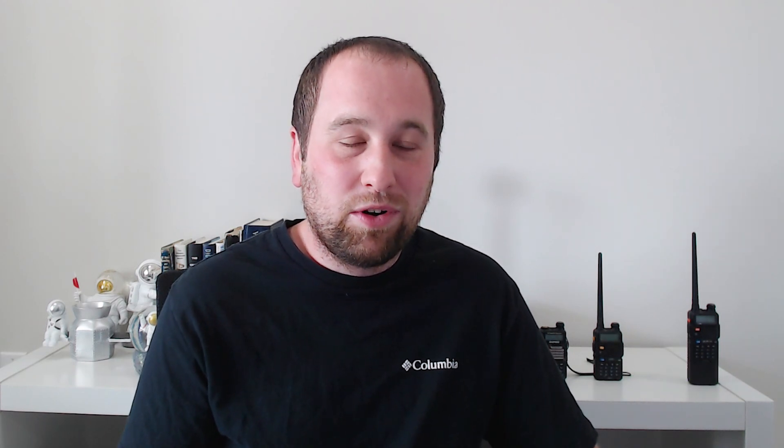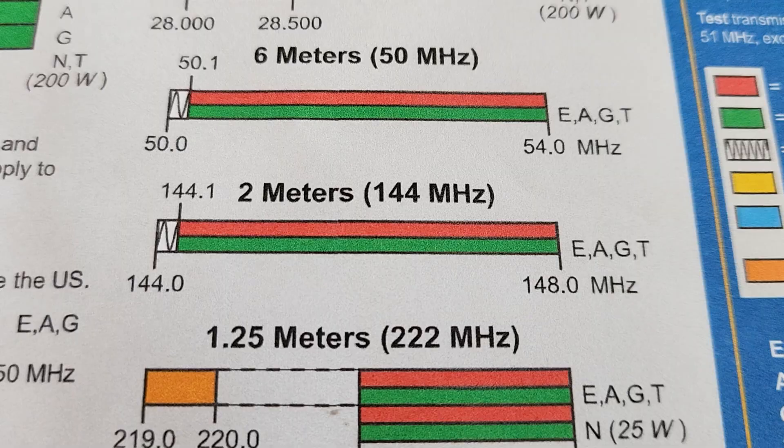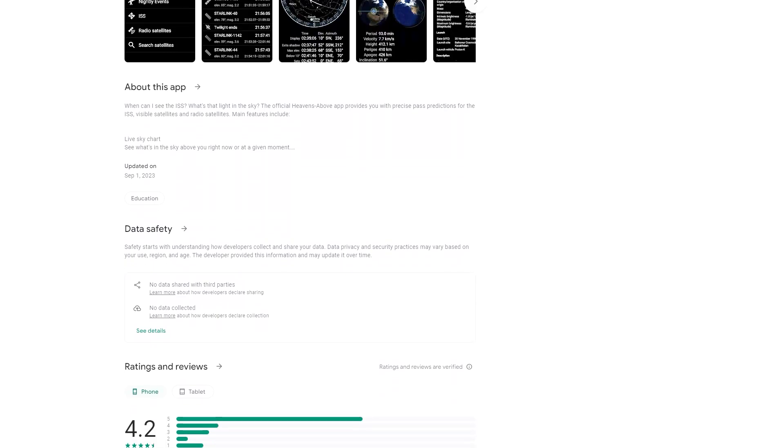Speaking of satellites, there are actually many amateur radio satellites circling the Earth at any given time, and the odds are one is flying by your house every few minutes. Most of these satellites work in the 2-meter and 70-centimeter range, which is what these Baofengs work with. Because of the 2-meter and 70-centimeter band characteristics, they're actually really good for Earth-to-space and back communication, which is why the Baofeng works well for that. You don't need a high-power radio — as long as you have a directional antenna, you can pick up those signals very easily. There are apps you can use on your phone to find when these amateur radio satellites are passing your way.